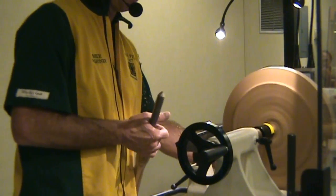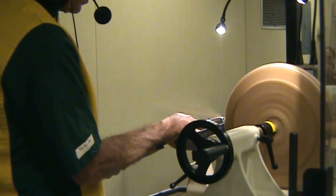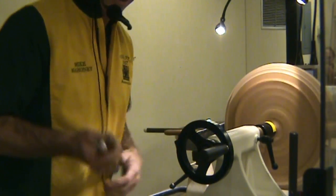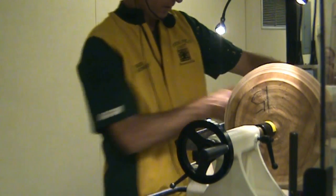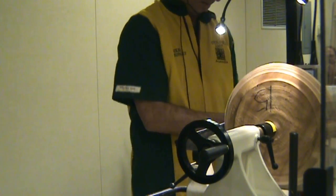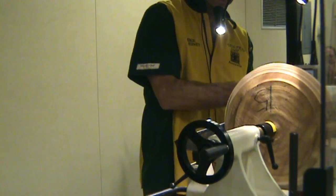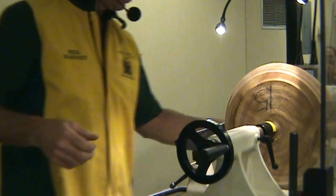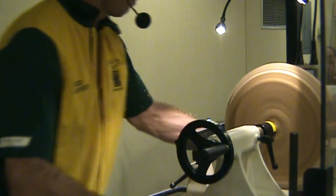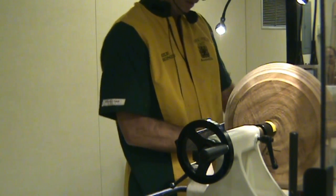Now I'm going to form the shape. That's the lathe, not my chuck. Maybe I can tighten up that belt — that's the first place we'll go. If not, I will decrease the speed. That's on there pretty tight, so let's crunch it down a little bit. If that doesn't work, we'll try something else. That didn't work. I'm on the highest speed here, so I'm going to drop down to low — hopefully that will give me a little more torque.